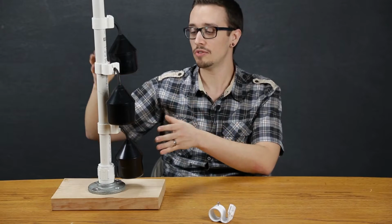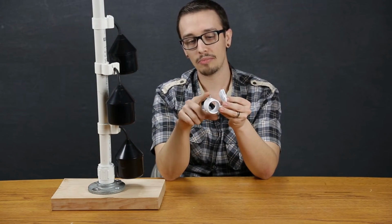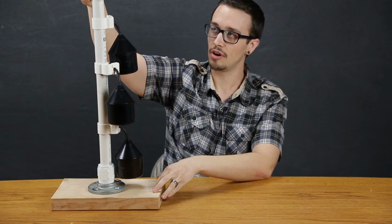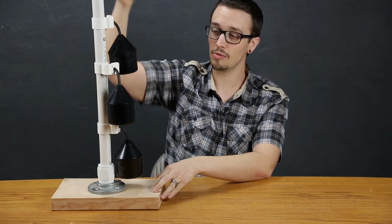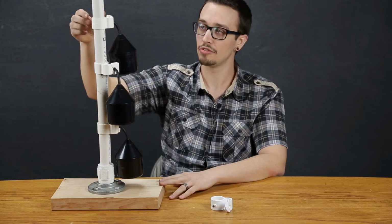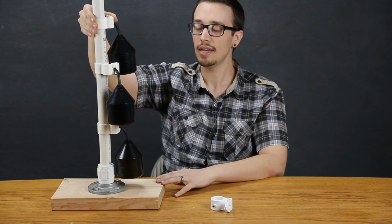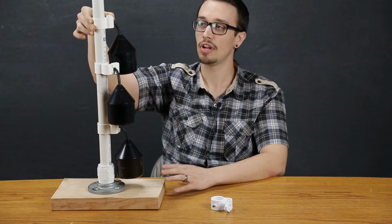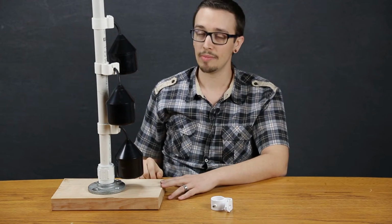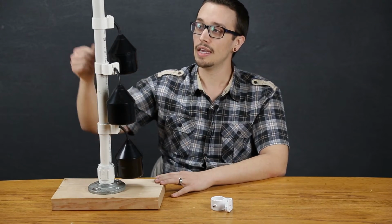Another nice thing about the float collars is that they have the little screw on the back here, which you just tighten once you've got your collar set in the location that you want. They're super quick and easy to adjust. You grab your screwdriver and loosen it up, move it to exactly where you want it to be, and then tighten it down, and you're never going to have to worry about it slipping, sliding, moving, or rattling loose. These collars are excellent in terms of just staying put, and super reliable.